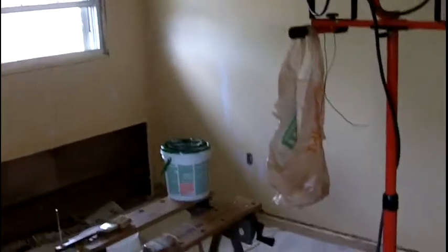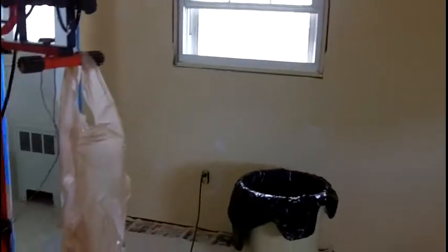Hey, what's up everybody — continuation of my painting of the bedroom. First coat is on. Last you saw was my fiancée videotaping me painting this, so then last night I threw on the shop lights and went around and saw stuff that was highs and lows. I'll sand it today — right now I'm just cleaning up the room, get all the material out. Maybe I'll have her hold the shop vac. For the most part all the walls are not bad — a couple of spots had a little pinhole, but it is what it is. Alright, I'm going to clean this mess up and sand it, try to put on the second and final coat — if I need more then I need more. Thanks for watching, be right back.